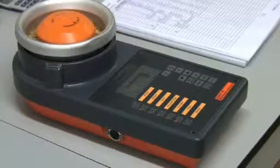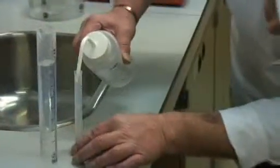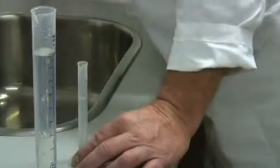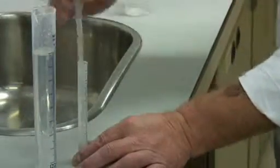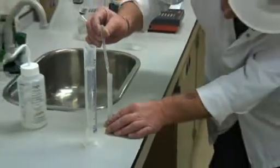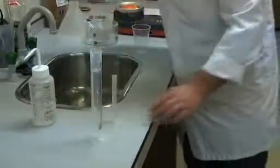To allow conditioning to be undertaken effectively, the grain moisture must first be determined, and from this the amount of water that needs to be added to a fixed amount of grain can be calculated. Once this is done, the water is added to the grain.